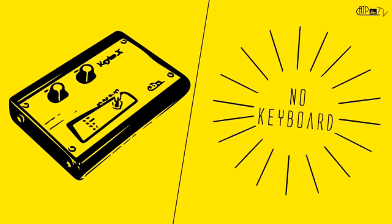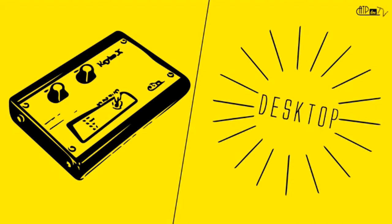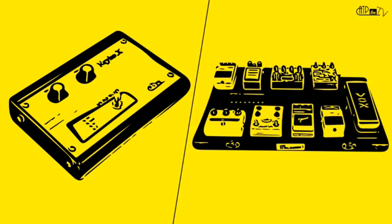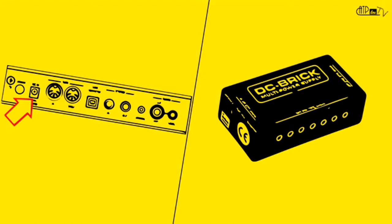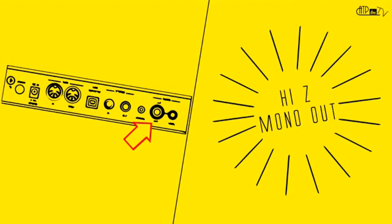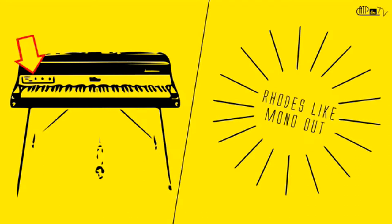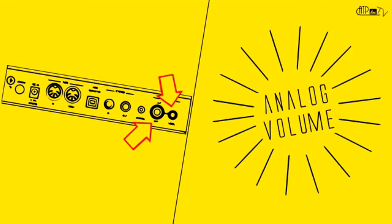We put in the most pure and direct voice of some of the best and most iconic musical instruments in modern music history. We left out the keyboard so you're free to play these sounds back by any MIDI controller you like. We've designed an expander in the form of a stomp box that you can use as a desktop unit or easily put into any classical pedalboard, using a negative center 9-volt power stage compatible with standard single or multi stomp box power supplies. The signal path is optimized for great playback by a dedicated Hi-Z mono output that reproduces the output stage of a vintage passive electric piano, matching the impedance of the real thing with a dedicated analog volume control.